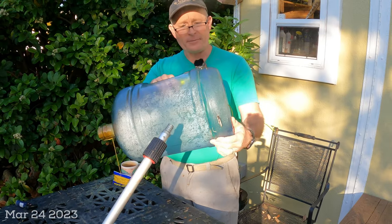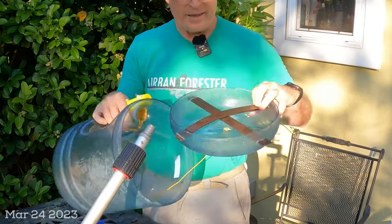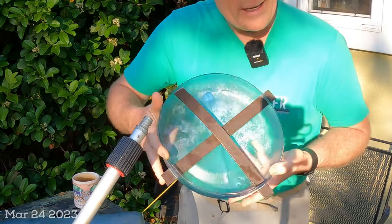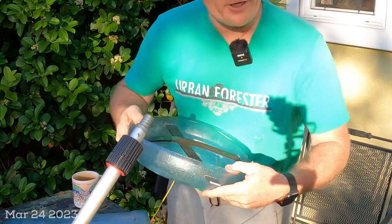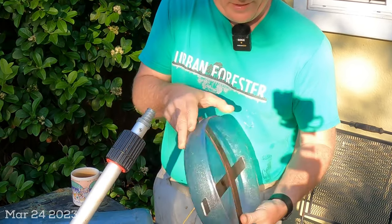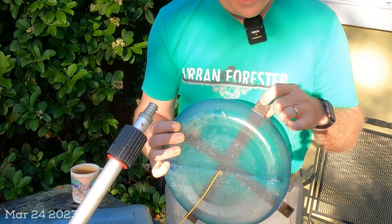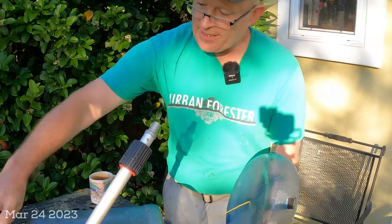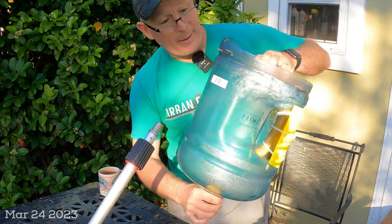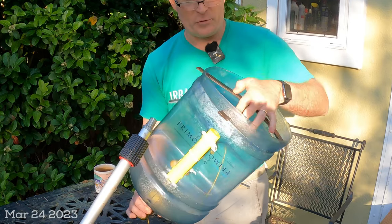I cut the bottom off so that the lid can be inverted and pulled into the top. These are plastic crossbars — this was a modification I didn't realize I needed. When it's cut, it needed a little bit of rigidity. I took some hard plastic strips and cut them in there in a cross fashion. The important thing is they stick out here — see how these stick out? When this lid closes, it pulls down to those stops, so it's important that you have something that sticks out and gives rigidity.